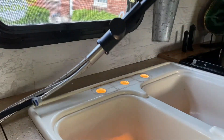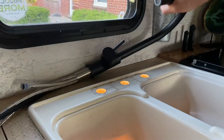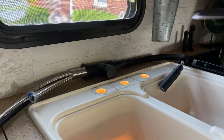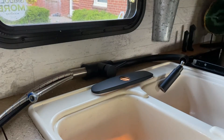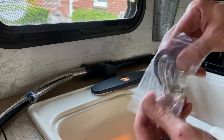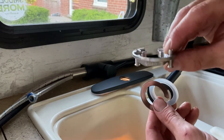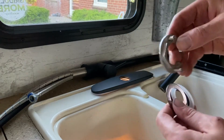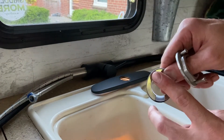Now this model having just a single valve operation, we're going to go through the center hole and use the cover plate supplied — it'll cover the other two holes like so. Instead of having the two nylon lock nuts underneath, we're going to use this series of connectors. This will be threaded on that center shaft and then we'll torque it down with the screws from underneath to draw it down tight. Obviously the gaskets and the clamping plate are right here in the set.